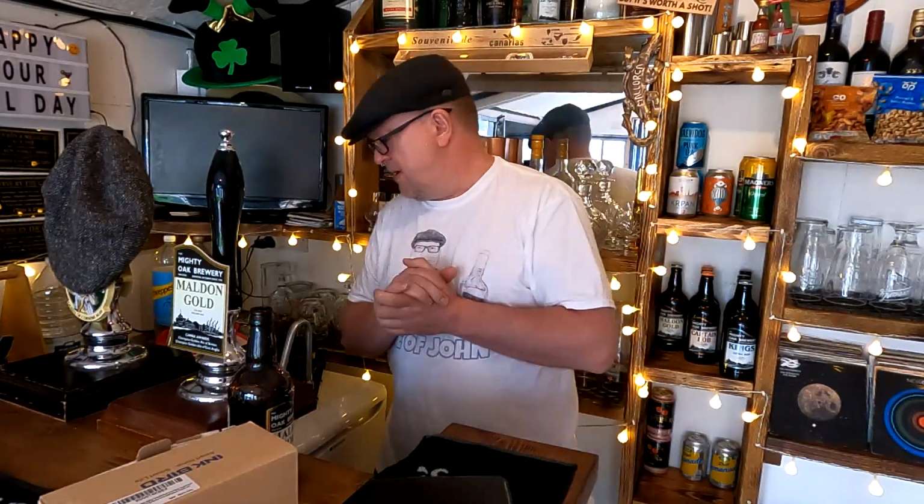When it gets to over 22, that will start cooling it down. Some people set it at half a degree. I set it at 2 degrees at the moment, just playing about. As I say, I haven't set it up properly. When I get the Wi-Fi one fitted in, I'll set it up properly and leave it. You shouldn't need to fiddle with it, but I'm like that with technology, I like to fiddle about.